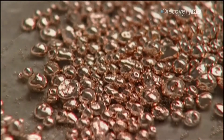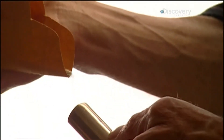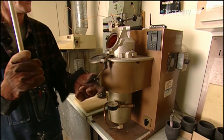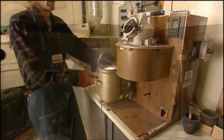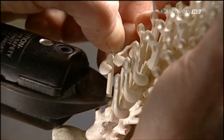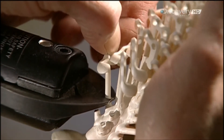The keys are made from tiny particles of silver or gold. These ones have a reddish hue because of their high copper content. The craftsmen pour a carefully measured amount into the casting machine's upper chamber. The machine heats the metal for 12 minutes. The plaster flask goes into the casting machine's lower chamber, and they release molten metal into the cavities. Using a pneumatic cutter, craftsmen snip off the key parts.